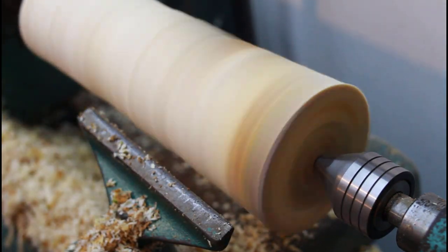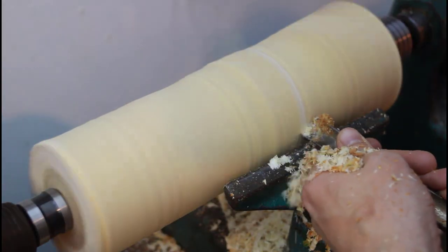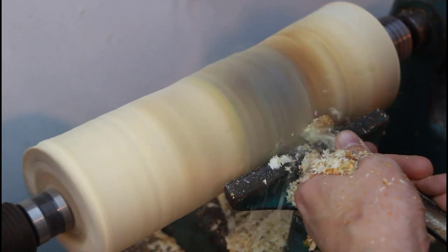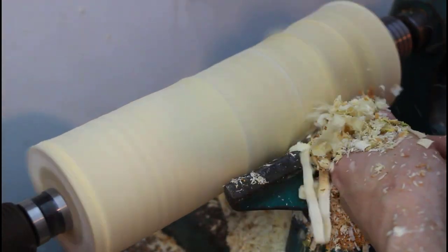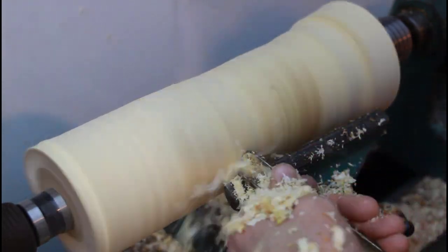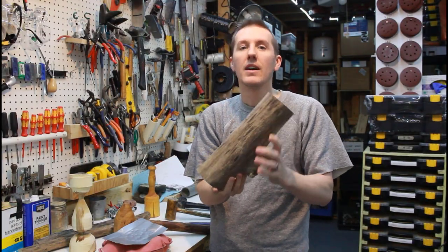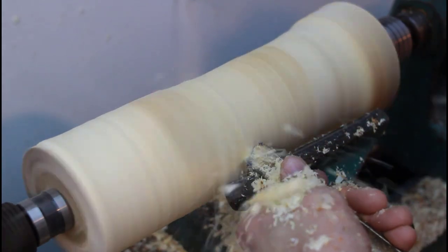As far as what wood to use — this one I made out of cottonwood and it was really easy to shape because it was green wood. This is a mallet I made before, also cottonwood, but it's for really light work. If you hit it really hard it's going to dent. Ideally you want to use a hardwood. The wood I actually used for the main mallet was a dead piece from the yard with very tight growth rings — really dense and heavy. This is perfect, and I've been using it with no marring or denting.